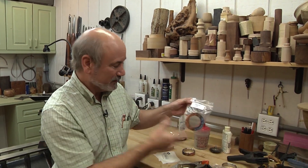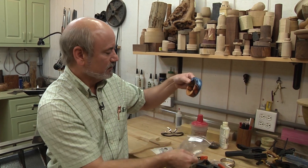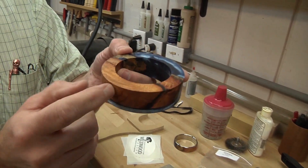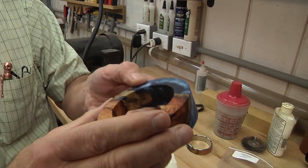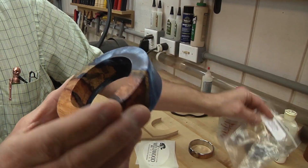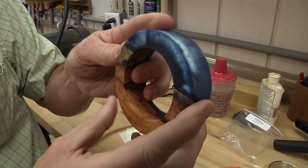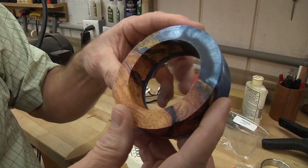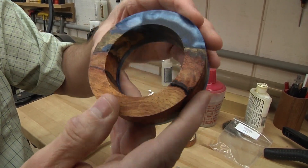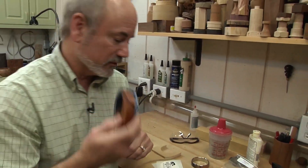He makes his own blanks that you can use. I've been around dry wood before - this is really, really dry. He gets some really cool burl. This one is called Afzalia burl and it has voids in it. So he goes ahead and gets a resin, impregnates it in there, and then uses vacuum to seal it and bring it in tight so there are no voids in this. When you turn the blank, it's a beautiful piece of wood. So this is what we'll start turning with today.